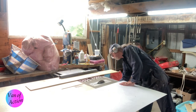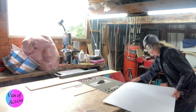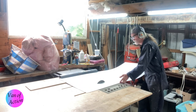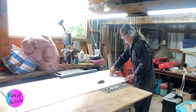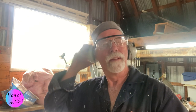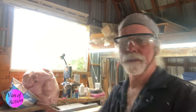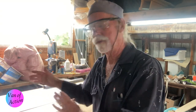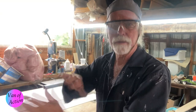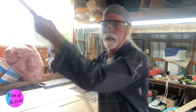Notice this maneuver. In this particular cut the sheet is a lot longer than the cut is wide, so I just set it up on the blade, hold the back end nice and high so it's flat as it passes past the saw blade, and just push it through. Now, as I was cutting it before, did you notice I rotated the sheet? I always want to have the factory edge against the fence. The first cut had the factory edge against the fence. The second cut I rotated it so the factory edge was against the fence again — this just makes it easier to do it right and make it straight.